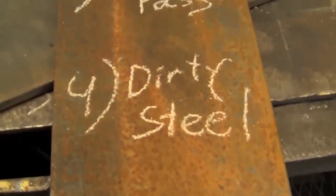Fourth most common usage: dirty steel. When you're going to weld something, you really want it to be as clean as you can possibly get it, but sometimes that's not very clean. If you have to weld something that's rusty, dirty, painted, oil-soaked, and you just can't get it clean for whatever reason, 6010 and 6011 can both burn through a lot of crap — although, like I said, you're better off getting it clean.